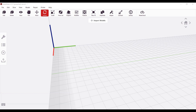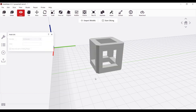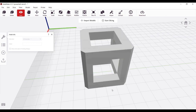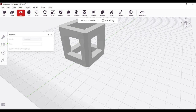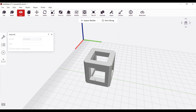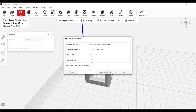Our next model is similar — it's a wireframe cube. On a normal 3D printer it's probably doable, but you would need to use bridging to print in midair along all of the sides on the top, or you would need support material from the bottom part of the model to the upper arms and then break it away when done printing. Let's go ahead and slice it and see what we get in the default orientation.